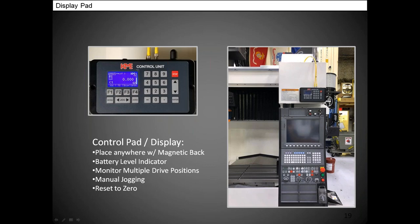So when we came out with the wireless systems, you can have up to 40 KME tombstones in your pallet system at the same time. You can share them with four or five different machines using the same keypad. So each tombstone has its own address and its radio frequency. It's not Bluetooth and it's not Wi-Fi. It's actual radio frequency, and that's where the RFs come into play.